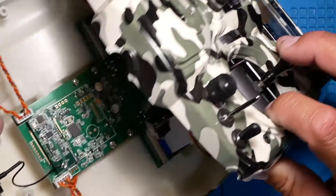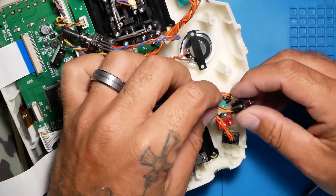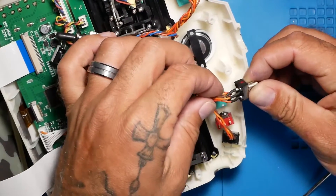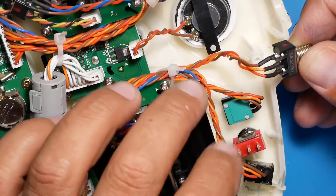Let's go to the back side. This is our old switch. We are going to heat up our soldering iron. To keep me from losing orientation, I am going to do one wire at a time. Your other option is to write down your color pattern — brown, orange, red — and then solder them on in that order. Whatever makes you happy.